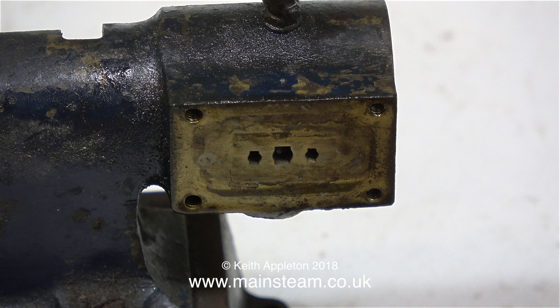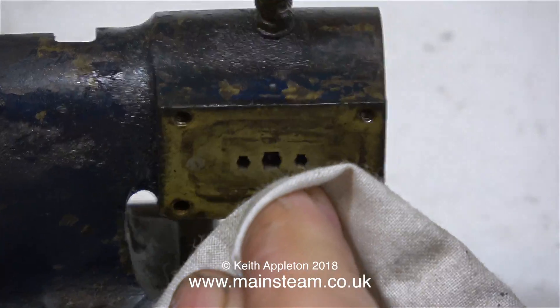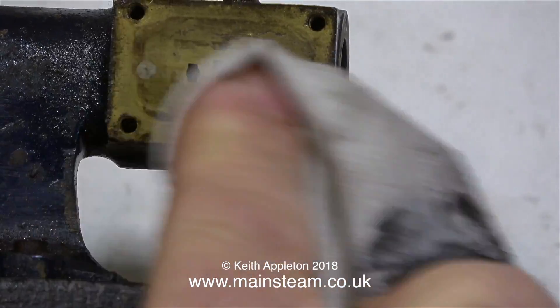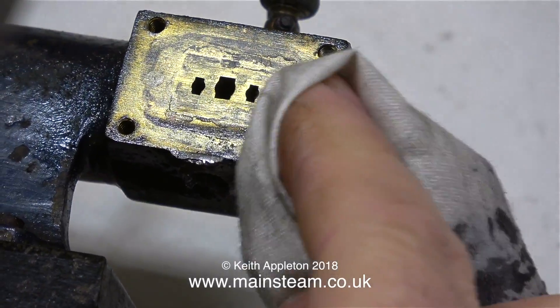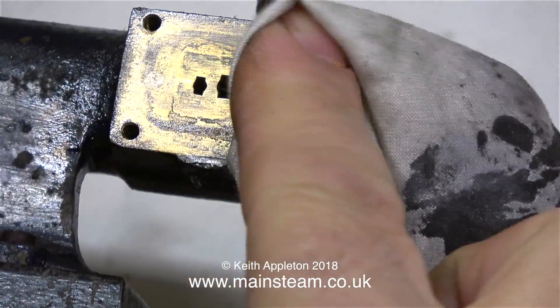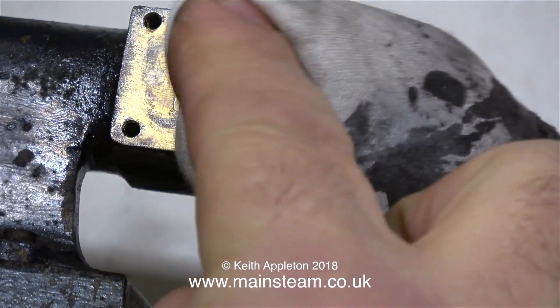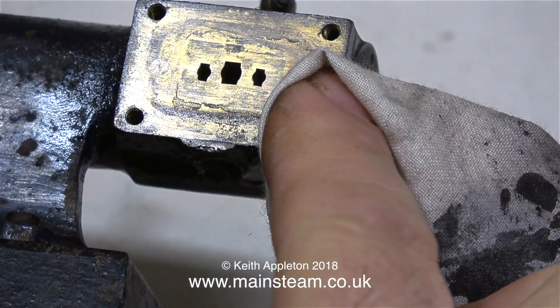The port face is in good condition too. Because the cylinder is part of the main casting, you can see to the left on the port face there's a plugged hole. This is not a mistake — it's the way the steamway into the cylinder has been drilled. I'll just give the port face a bit of a clean with a cloth to see what condition it's in. The good news is it's in pretty good condition — a bit oil stained and it's been stood for a long time, but the surface under the grime is in good condition.